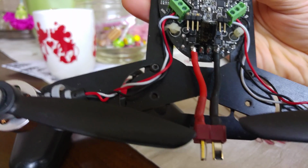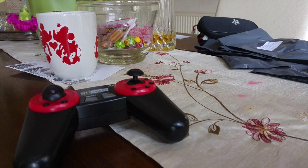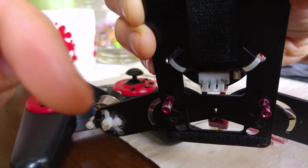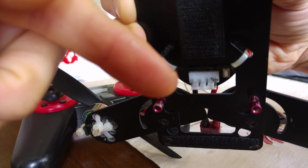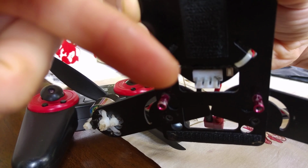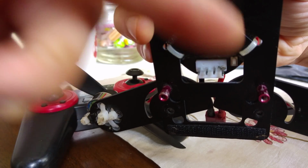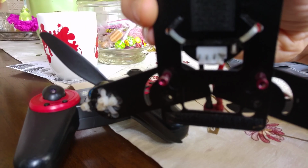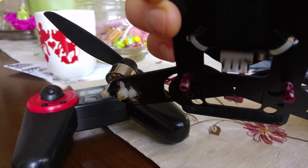So I had the idea, well, when I made a battery mod for underneath, and if you go to my channel, you'll see a demonstration on this. There's 4 pins underneath which are soldered directly onto the flight control board. Now, when you do the adapter, you're doing the same as on the top. You're only using the 2 outer pins, so then you can use different batteries. I've made an adapter that works with a Dean's connector and also a JST connector, but it's very short.